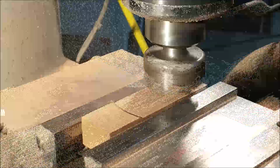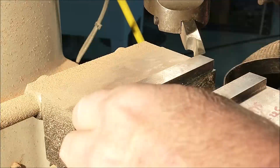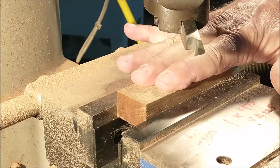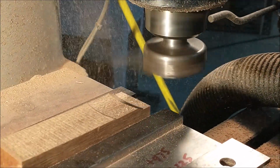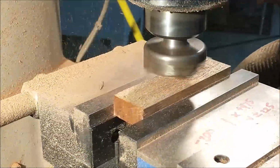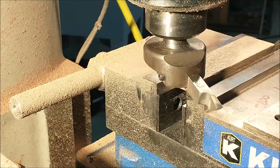With the exception of using some sandwich blocks to avoid chipping, the preparation of the axle block is going to be done exactly the same way as the frame was. I'll bring it to thickness initially, then I will do the outside surfaces, split it, and then put in a square collet and finish off the rounds on the end. Stick around for that. That was a lot of fun.